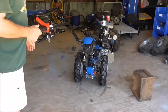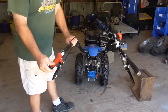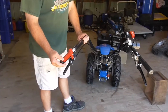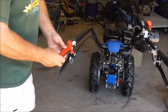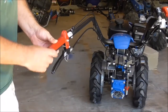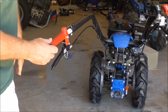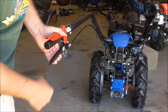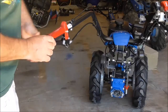Some other controls: you can see this handlebar here. We've got this safety lever, or operator presence control — dead man switch, called different things. Bottom line is the machine's not going to run unless this lever is held down. How do you start the machine if you can't stand here and hold it? You pull the clutch lever — this being the clutch lever — bring this down, pull the clutch lever up, lock it into place, and there you go.